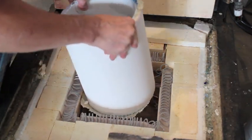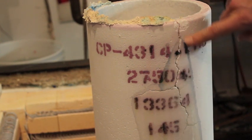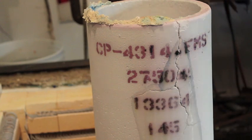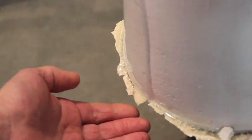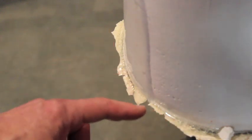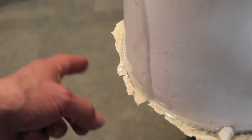There's the crucible crack, and here's the seepage — there was a bit of seepage. I probably could have stopped it a day or so earlier. It just lifts right up out of the furnace because I've sat the crucible onto about an inch of grog, or pre-fired clay bits. If there's any seepage, it soaks into the grog or the clay, and it doesn't start to erode the soft kiln bricks underneath it.